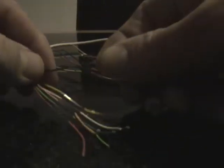So what I'm going to do is get my cutters round about here, and just take the plastic coating off, exposing the bare cables inside each conductor there. You can see it shining, and I'll do that on the end that we said we're going to be repairing there. So now on both ends of the cable, I've stripped about a centimetre or so of the sheathing back on each side of the cable.